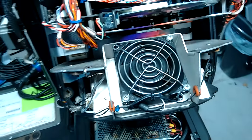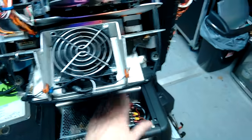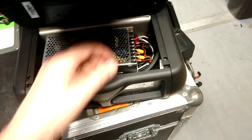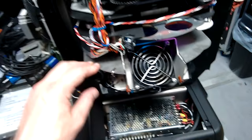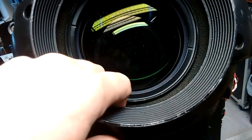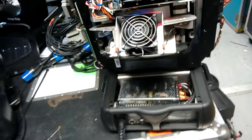When these fans are failing, they tend to replace them with 24-volt ones now, utilising the same cables but relabelling them — they get swapped down below onto the 24-volt side. Then you have to counterbalance the unit by adjusting the balance weights, these fine-tuning balance weights, just to keep the head in balance. They're great lights — very, very impressive, with an incredible light output. And the incredible ability to crush fingers if you put them in the end while it's focusing! Very, very expensive lights — not something you're going to get from your local disco shop, but very, very good indeed.